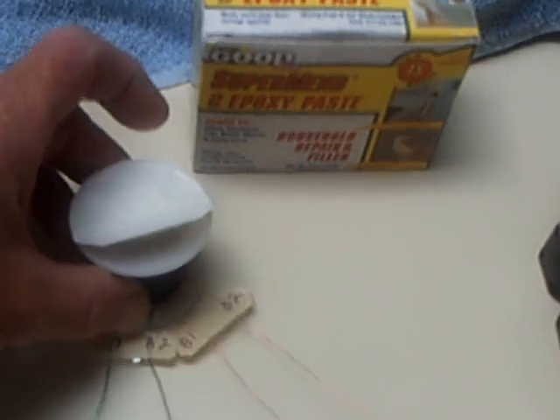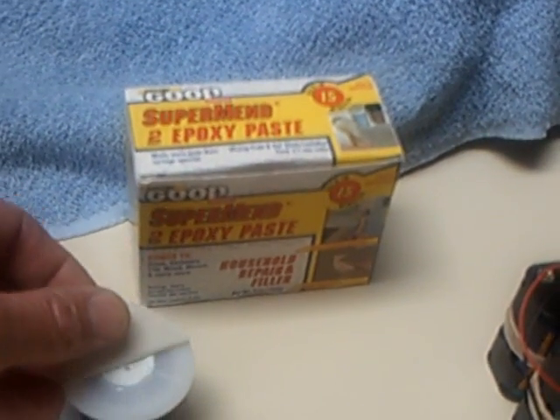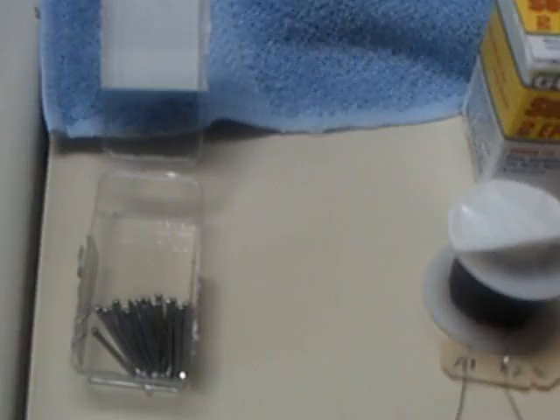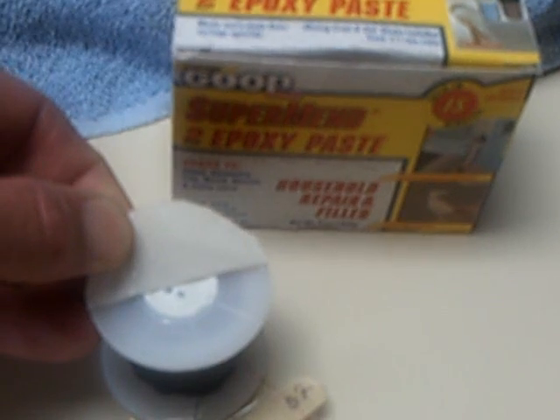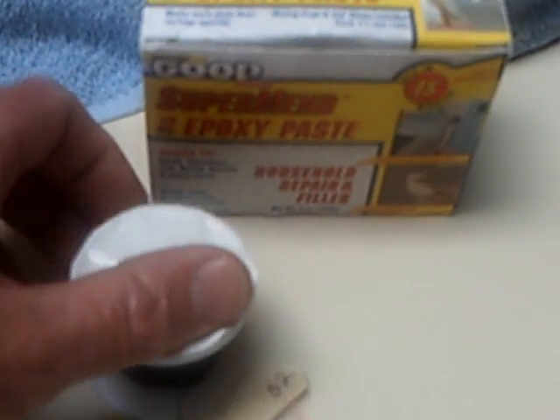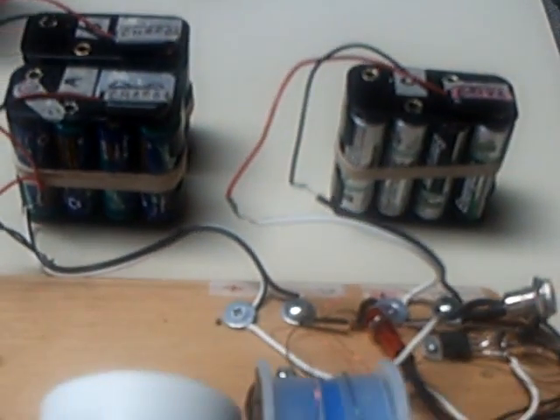Real quick, to explain how I did it — I just wrapped it all up on that coil by hand. When I got done, I didn't have any copper-coated welding wire, so I just used nails. I found out somebody else is doing the same thing — you just put the nails down inside the coil and fill it up. Then when you're done, mix up some epoxy and stick it down in there to glue it all together and seal it up. That's the coil that is driving this thing, and I don't think it would have worked as well had I not done it this way — the thing was extremely successful with that coil.